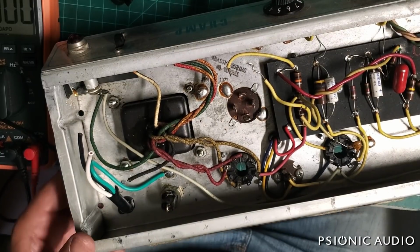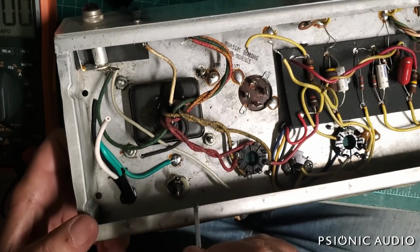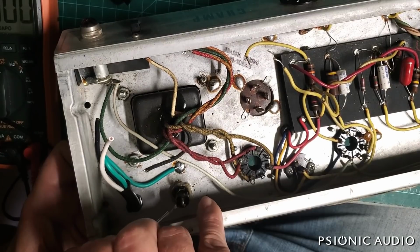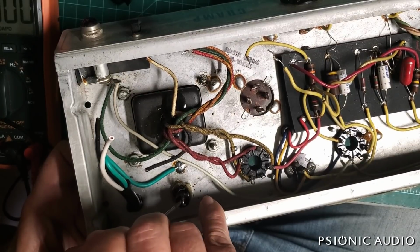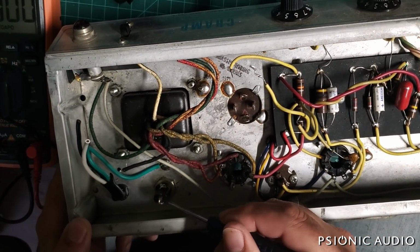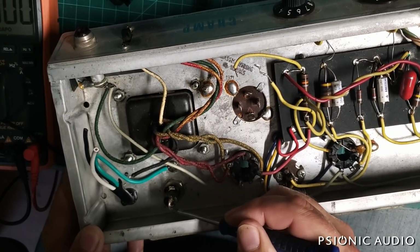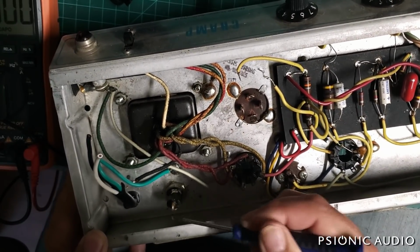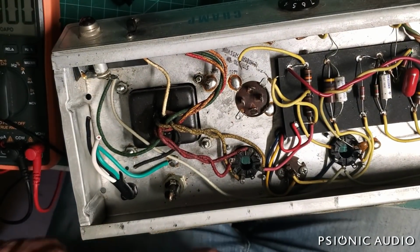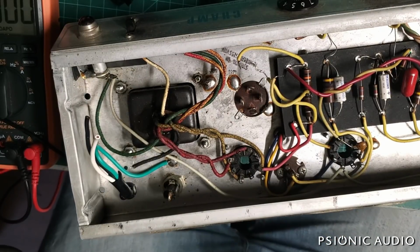Now, I don't think I've ever shown this in a video, but I don't know if you can see it, but these fuse holders and a lot of things in old amps get kind of a brown coating on everything. I like to get in there, just kind of scrape it away. It's old flux and it's old funk and all kinds of stuff. I just use a small flathead screwdriver, which can break through the outer layer, but I'm not using enough force to scratch or abrade the metal beneath. Get this side we can't see. And then, once again, a little bit of ISO often does wonders for these things, just getting the bits of dust and stuff that a screwdriver doesn't want to get up.